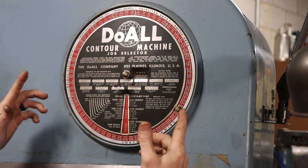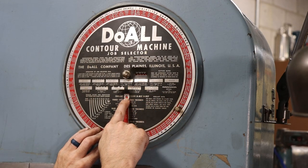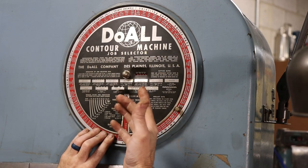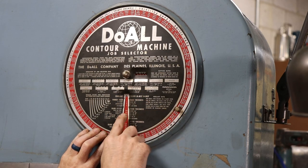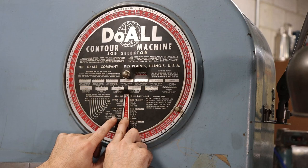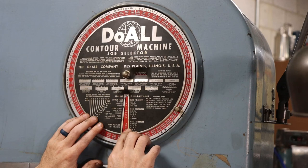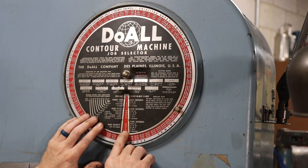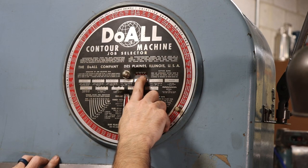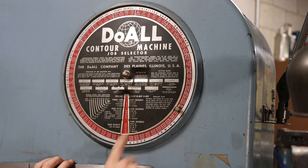Let's say 4137, we wanted to cut that grade of steel, and our piece is an inch thick. So it recommends we use a mist coolant. It recommends heavy cutting pressure. What that is, I'm not for sure, but it recommends heavy. It's saying we should use a 6 tooth per inch blade, which is a precision blade. This is based on a carbon steel blade, right? This is not bimetal. And then it's saying we should run our blade at about 50 surface feet per minute, and we should expect 0.65 inch travel on our feed. So pretty neat. I'm glad to add this, man.